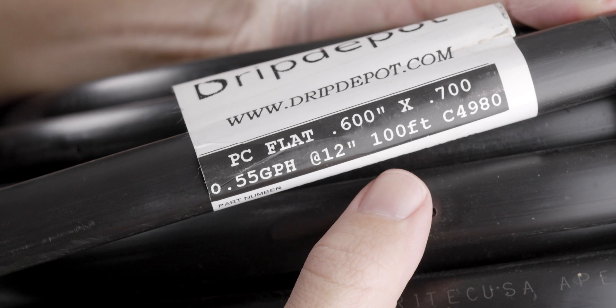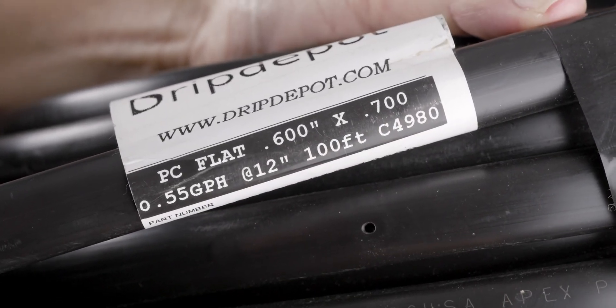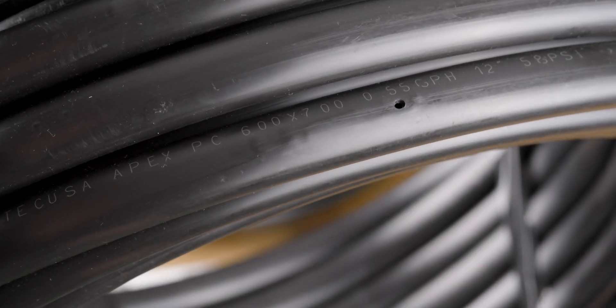The easiest place to check is the specifications for your tubing. If you still have any of the packaging or the receipt, you may find it printed there. Sometimes it's also printed directly on the tubing, though it will quickly wear off if the tubing has been in use. If you know where you purchased your tubing, many tubing retailers will show the full specifications for the item on their website, or they may be able to provide the information to you. If you cannot determine your tubing's diameter with any of those methods, you can physically measure your tubing to determine its inside and outside diameter, and you may only need one of those diameters depending on what type of fitting you're using.